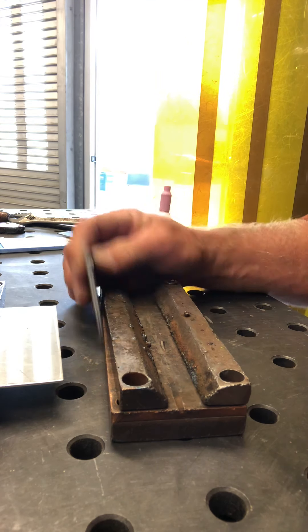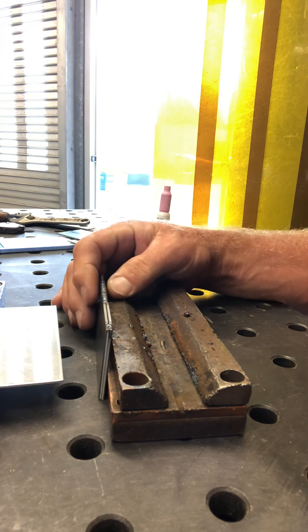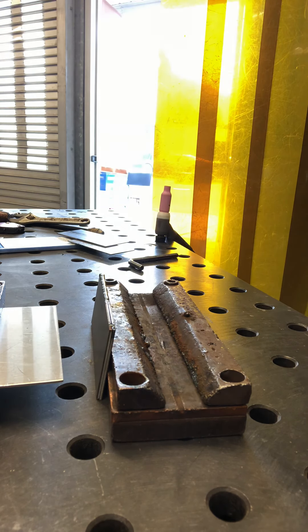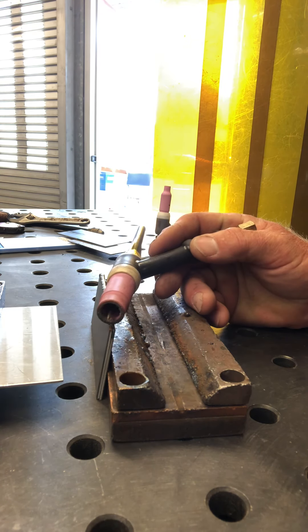When you're getting your pieces together, a lot of people struggle figuring out how to do this edge joint. I saw it done in a number of ways — people used a magnet and fried them. A couple students put it on the side and it worked really well. When starting the torch, one of the really big keys is to always lay it on its side on the material.